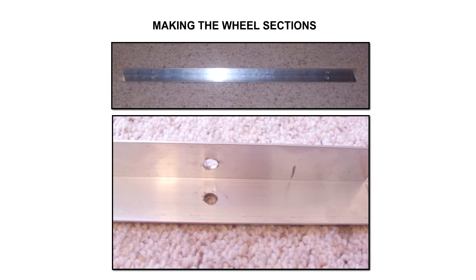Right, let's start off by marking the sections that hold the four wheels to allow the dolly to run onto the rails. Take your length of 32 by 32 millimetre, that's one and a quarter inch, aluminium angle and cut two pieces that are 800 millimetres long, that's about 30 inches. On each piece, measure in from each end 100 millimetres, four inches, and make a mark on both faces of the angle exactly in the middle of each face. These holes are going to be used to bolt through the skateboard wheels. We have eight wheels so we need eight holes. You need to drill these holes the same diameter as the bolts you bought for the wheels - they usually are 8 millimetres, five sixteenths of an inch, but check the bolts first. When you are finished you should have two strips of angle each with two holes in each end.